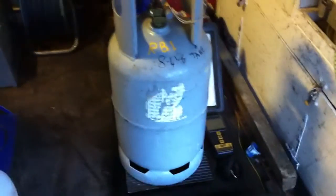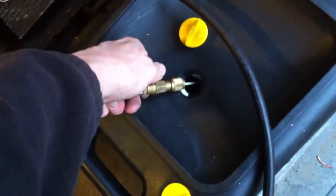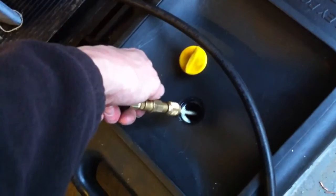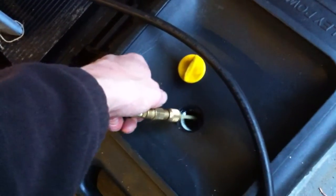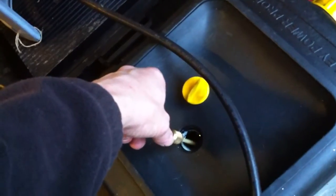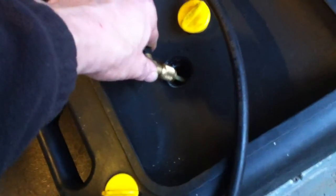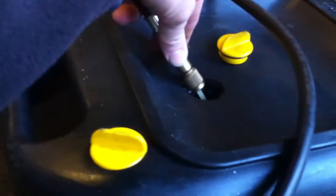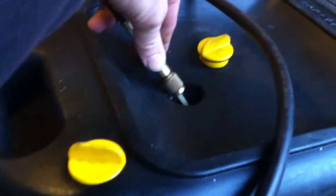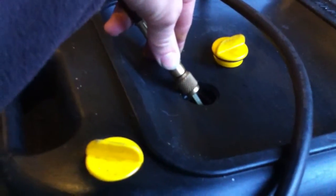Let's see if we can drain that out. There's about one or two pounds pressure left in the bottle. Now this was caused by the contactor stuck in, the solenoid shut, and the compressor just pumped all this oil out and seized up. And when I took all the refrigerant out putting a new unit on there, all the oil came out with it.